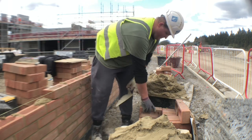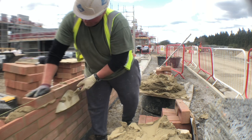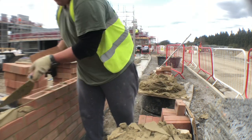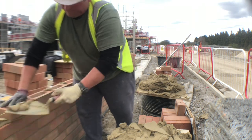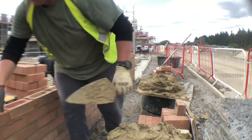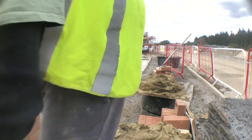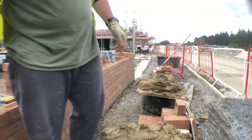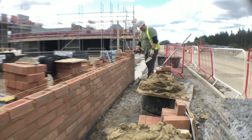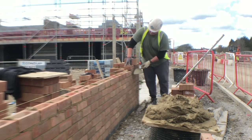I built up, tailed out about eight or nine bricks, returned it round, did it over the level, put a profile up on the far return just to take one plumb point away. Then as you saw in the first pictures, I did the same with the other pillar but stuck a profile up to take two plumb points away — one was a ranging profile, the other just to take a plumb point. Then after getting up to about six or eight courses I moved the profile over when I knew it was running true and plumb, using the profile to run in and tail around, racking the pillars back.